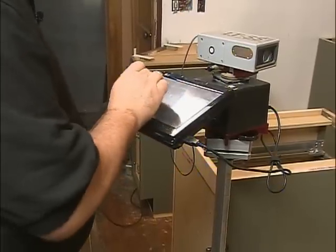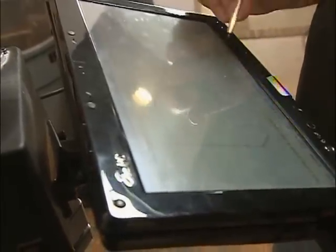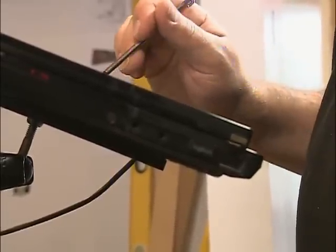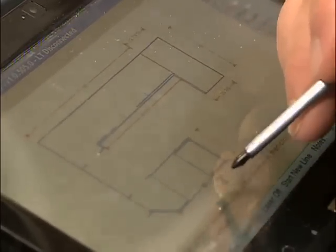Now you're also doing some backsplashes for us, and so how do you go from measuring horizontally to measuring vertically? Well, because this is a full height backsplash, we are going to come in after we've set our countertops, and we are going to measure up to the upper cabinets, and we'll just use a level and straight edges to compute all of that after we've set the original tops.